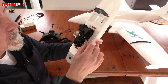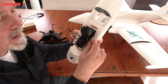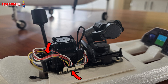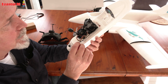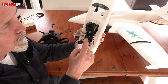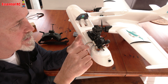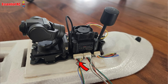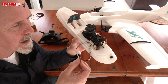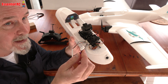This cable connects the gimbal to the mounting plate — it's provided in the kit. The next one is the DJI O3 3-in-1 cable that comes with the DJI O3 FPV camera; it plugs into the lower plug and goes into the back of the air unit. Then there's the power cable for the fan. On the other side, there's the gimbal power cable — also provided in the kit. I'm powering it through a balance plug going into a 3-cell LiPo, but you could use an XT60 as long as it's getting between 2S and 6S volts.